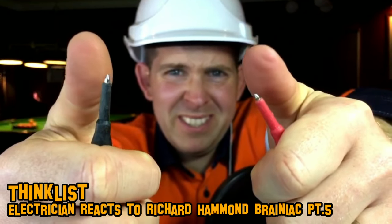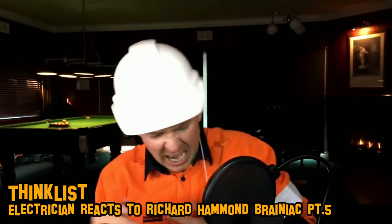I know what you're thinking — Dave, why don't you just hook up the active wire to the guitar? The RCD is going to protect you, right? Well, yes, but only above 30 milliamps. And as I showed in one of my other videos, getting shocked by 1 to 2 milliamps is painful enough. So I might just leave that to Mehdi.